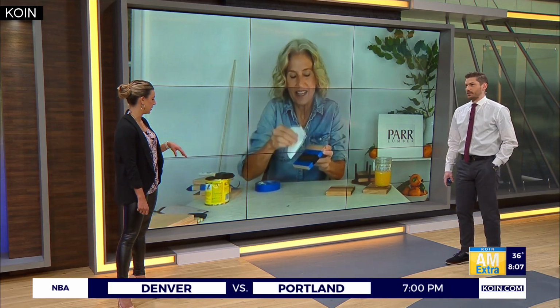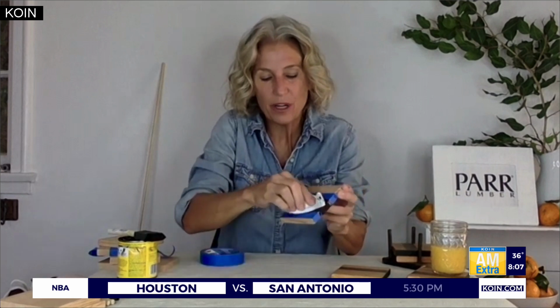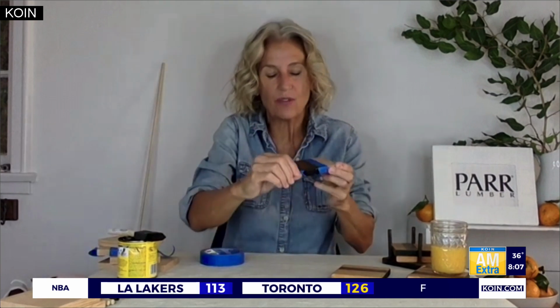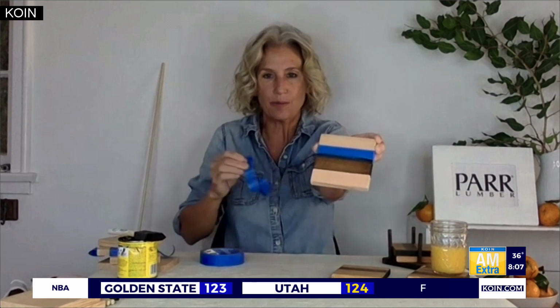See, quite a bit. That's how you can see the nice wood grain through it and all that. Yeah, that came on really black, didn't it? And then when you wipe away, you'll start to see the grain. Oh, that's great. And then it's very simple after that. You just peel away, and you're going to get that nice edge like that.